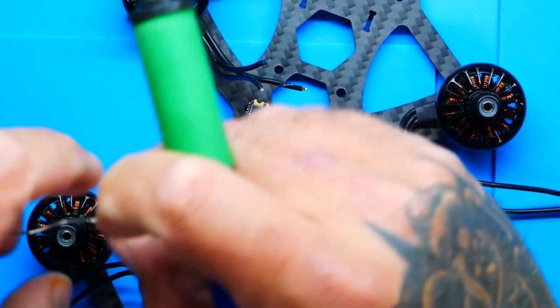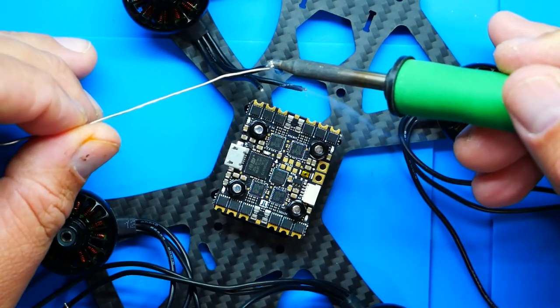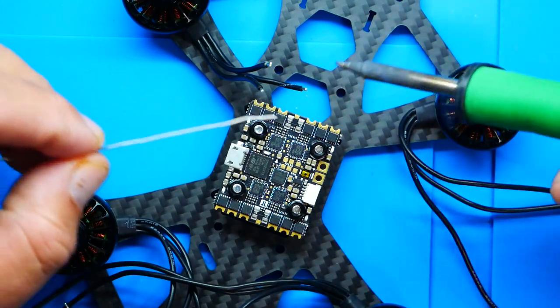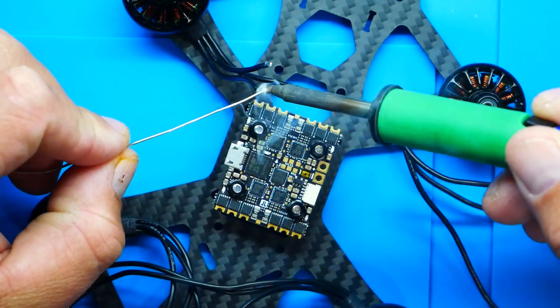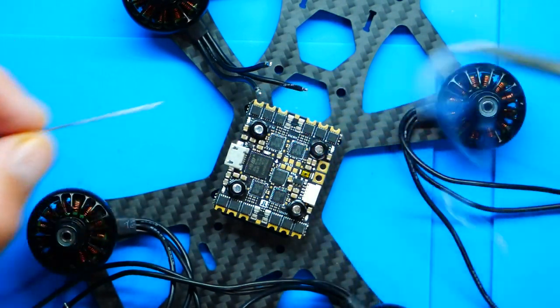And then I'm going to swoop in and cut all three. Boom. So now that we've cut them, we'll strip them. And now we'll go ahead and pre-tin them. So that's where you take a little bit of solder and you just get your ends wet. And it's really not even that much about having the solder. It's the flux that you're putting on them. And that's because the solder has flux built into it. So there you go. I have now tinned my wires.